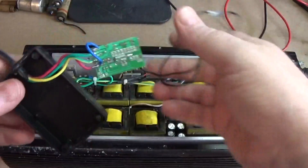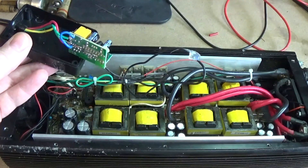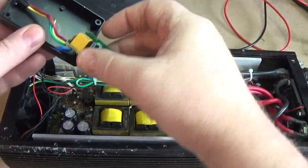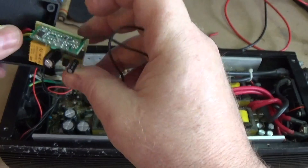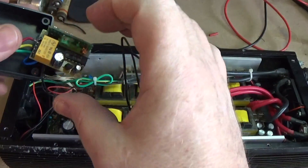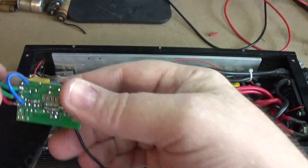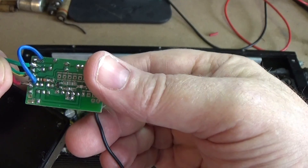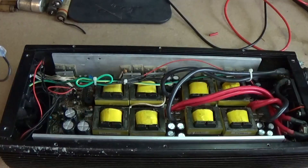I found this plugged into the side of it — I know what this is. It's a remote control, so you push a little button and it starts up presumably, and I think he might have lost that. Looking it over, you've got a tank coil and a little receiver circuit there. I'm not too sure what that chip is, but basically it controls through a relay. So all that controls a relay which turns it off and on. Here you've got contacts — common, normally closed, normally open.